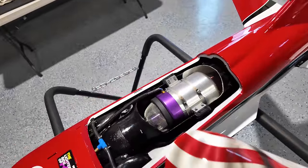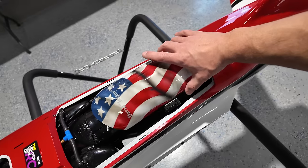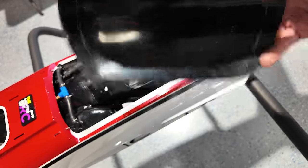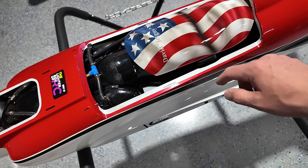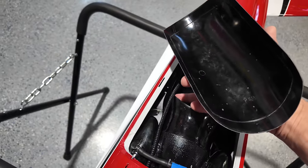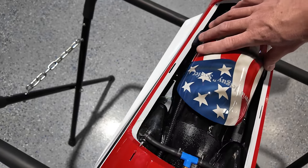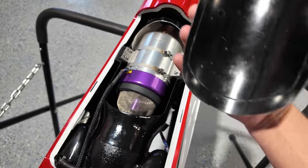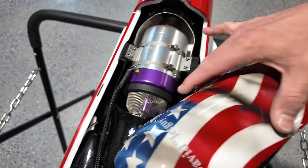So if we take a look at the bypass cover and how it sits in here, basically the nose goes forward. Now we've got to cut our ears out, or our little slots for the ears, and they've got a kind of a cutout done up on the bypass. So we're gonna get that done first. So do a little bit of chopping here to get those done. And we may have to do a bit of a cutout here for the turbine wire, but what we'll probably do is put that in the lower bypass section if we can, and avoid cutting the top section if possible. And basically once this is fit 100%, then we need to put some BVM ceramic paint on the back section to match up with what we've done on the pipe.